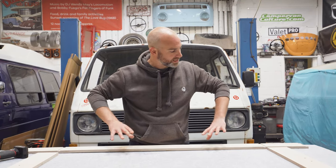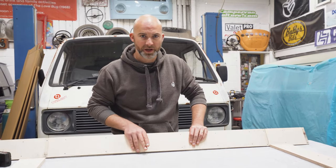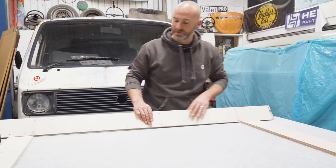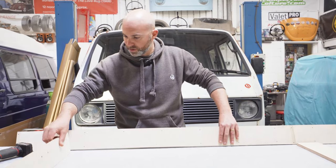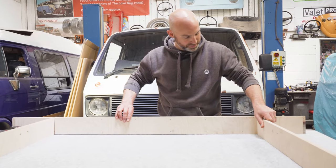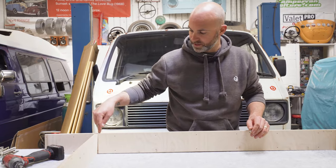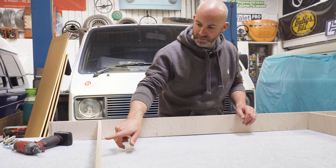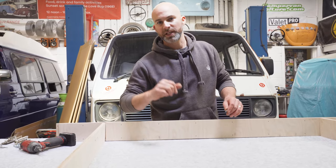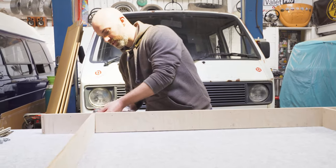The first thing we're going to do is attach the backboard to the first of the two sides. The backboard is labelled Part A — it's one of the longest pieces in the kit and has these machined grooves in the panel. Part B — there are two of them — simply slots either side, with the rear being closest to Part A, mainly because we need the hinge holes as far back as possible for the lid. Use your T20 bit and screw to attach from the back.